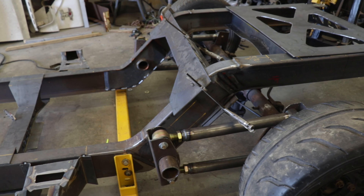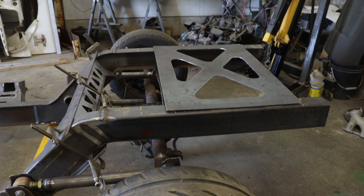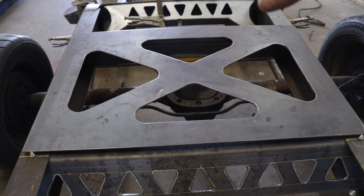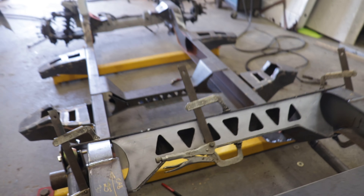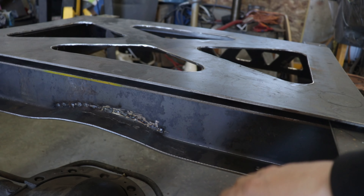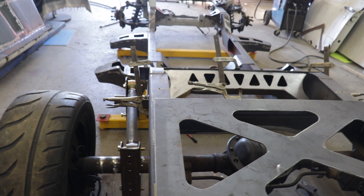It's really shaping up — super exciting when you make this much progress, because the end is in sight for this frame. Honestly, there's not a lot of work left to do. I went a little crazy off-camera and got some good progress done. There's a new rear crossmember, I made a plate that's going to go over top of the gas tank which really stiffens everything up and will be bolted along the edge. Another crossmember right at the bend on the frame, and another one over the rear end — I had to bend it up a little for clearance during travel. I welded up all the rest of the frame joints and made sure it was 100% laser straight, so now I can finish mounting the brackets on the rear end and everything for the four-link.